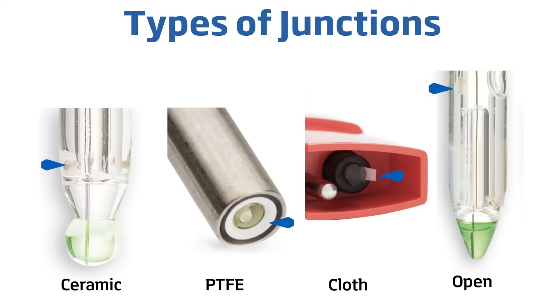The next aspect of the pH electrode is the junction. The type of junction used is one of the most important design considerations when selecting the right sensor for your application. The junction is the electrical pathway between the sample and the internal reference half cell. This reference chamber contains an electrolyte solution, which diffuses through the junction into the sample. Any clogging of this junction may result in erratic and unstable readings. A porous ceramic frit is one of the most common junctions for standard laboratory applications. An electrode may contain a single, double, or triple ceramic frit, allowing for enhanced electrolyte flow.